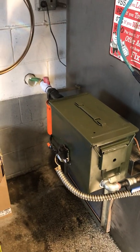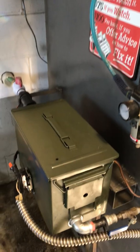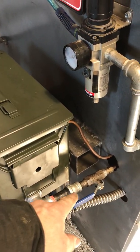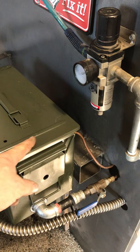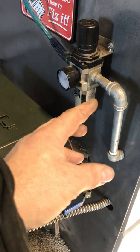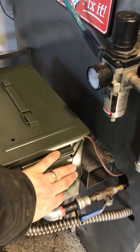I do have a magnet in there as well — it catches any kind of metal shavings that might find their way in. It's actually a loop, so the oil comes in here, and I have a shut-off valve in case anyone needs to service it, and it returns back. This gets it hot and it's just a continuous loop. The furnace pump takes what it needs and everything else runs back to the tank — it's a constant loop.